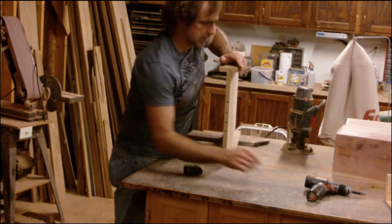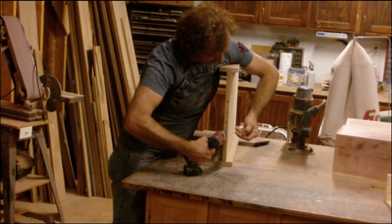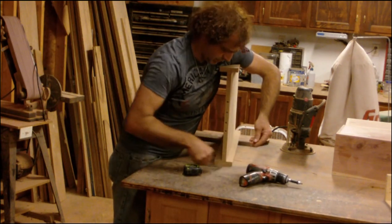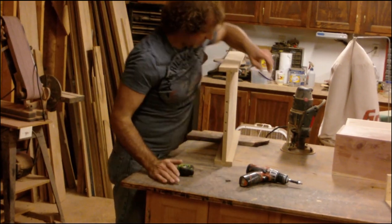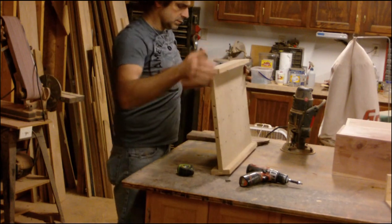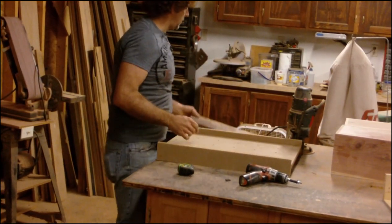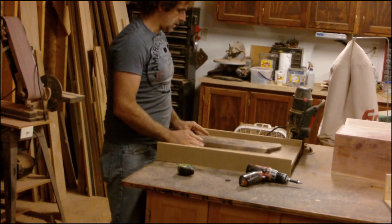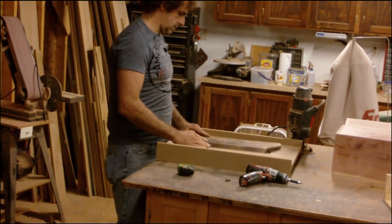And right here, I've got a row of screws that I use. I just keep these here for convenience. They are 1 inch drywall screws, because I don't want them grabbing the wood, but just enough to hold it. And with all these number of holes, I'm usually able to find a place that they will align. So, I'll go ahead and give a guess here. Try it out.